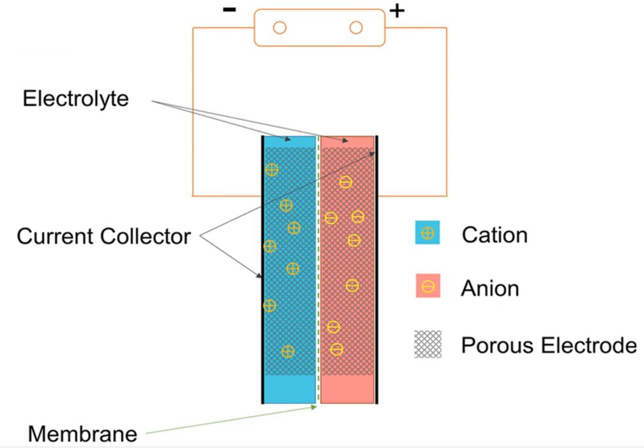Typical values are in the range of farads (F), 3 to 6 orders of magnitude larger than those of electrolytic capacitors. The capacitance value results from the energy W, expressed in joules, of a capacitor loaded via a DC voltage V_DC. W equals 1/2 · C_DC · V_DC². This value is also called the DC capacitance.